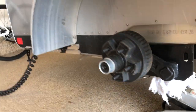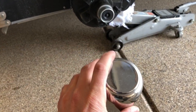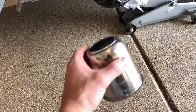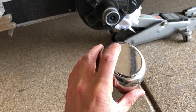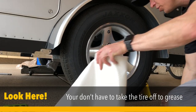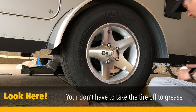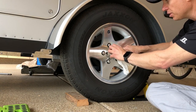I took the entire wheel and rim off, but you don't have to do that. Generally what's on there is a cap, and on this cap there's a top that pops right off and you can access the grease zerk from opening this cap right here. So you don't have to take off the wheel and rim to grease your zerks. I'm going to show you how — I'm going to grease this side without taking off the wheel, just by popping off this cover.